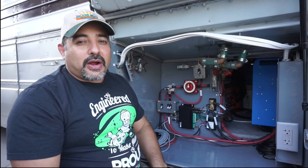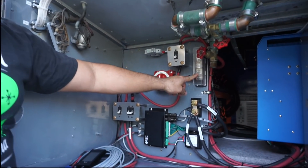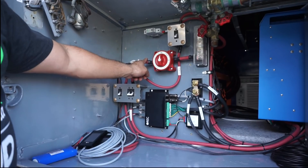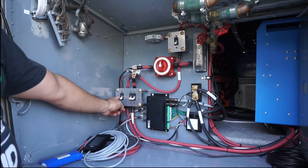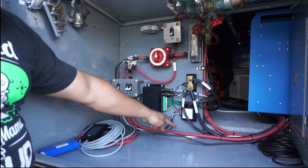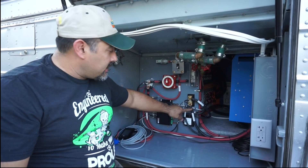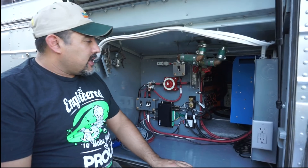When running off battery power, the battery comes through a 400 amp Class T fuse, then through a 350 amp switch, then through the main contactor controlled by the BMS. From there it's split into DC loads at 100 amps and AC loads at 200 amps. The 2/0 AWG cable goes back into the battery inlet of the inverter. The other side comes to the negative part on the shunt, so all loads are on one side of the shunt and the battery main is on the other.